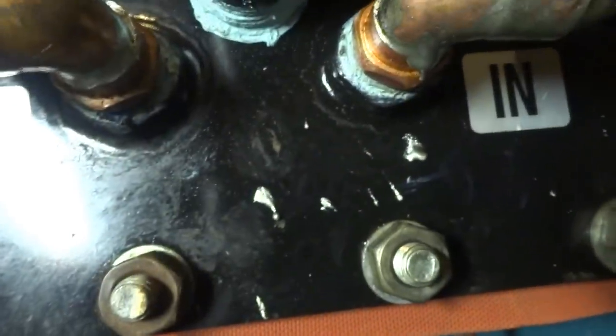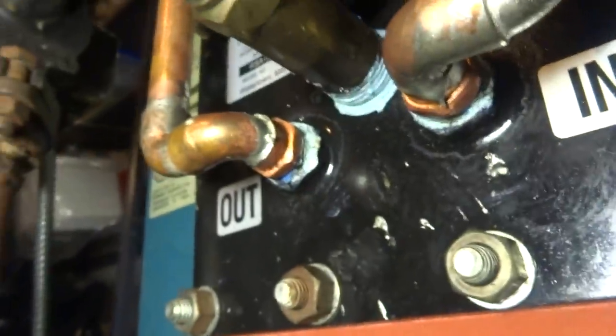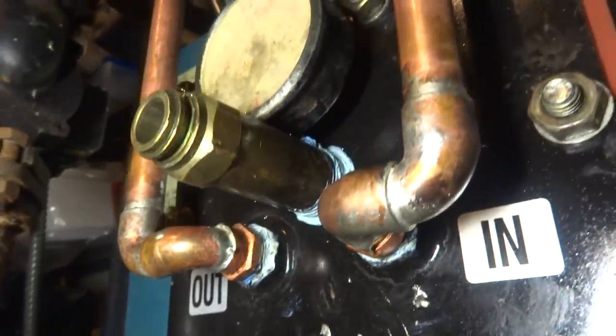One was dripping. That's the other one, I just like the one I have outside. Well, this one here, when I turned it on, it was dripping from the O-ring. So if I don't change it when I see a visual problem, I'm going to have another problem. We don't want that. All right, so the tank's filling. Make sure I got no leaks here, because this is kind of a tricky joint to do, because it's right against the... You gotta put the male adapters in first.